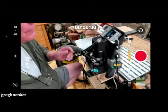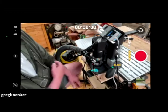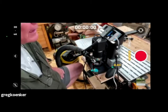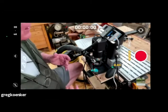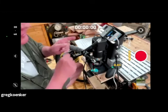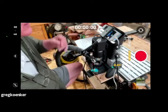a difference between this and, let's use that salmon as an example. If I had to go into that salmon and enlarge the pocket 3 times, all it is changing is this offset and running around the edge again. That's it. Test it. It's either good or I do it again.